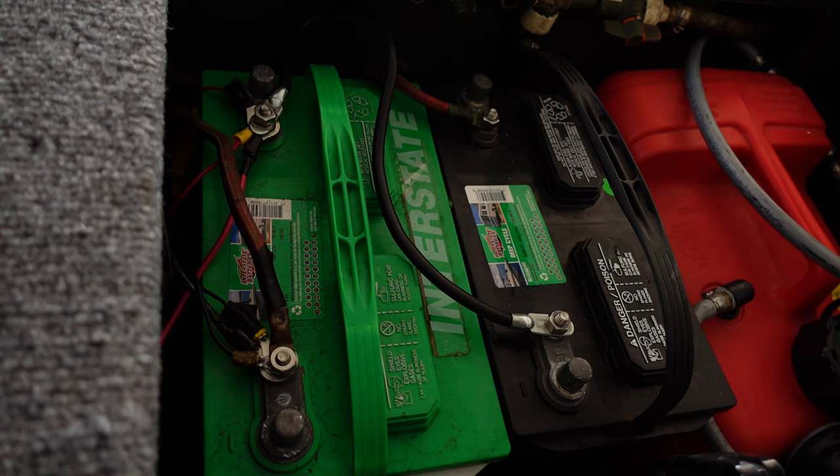So to summarize: negative trolling motor to Battery A, positive trolling motor to Battery B, jumper cable from Battery B negative to Battery A positive — now you're running in series and you have 24 volts, and the trolling motor should be at full power. The way this works: the capacity stays the same, so everything else — your units — is only going to get 12 volts. We're running the batteries in series, so we're using juice from both batteries, but only 24 volts is going to the trolling motor. I'm not a scientist, but I'm sure there'll be some comments below.